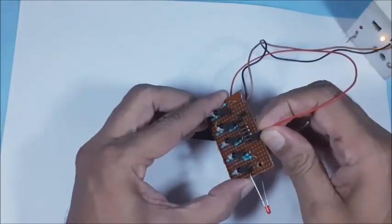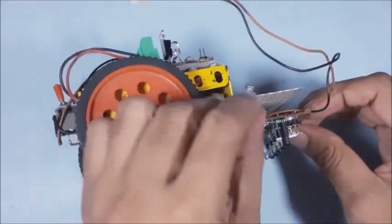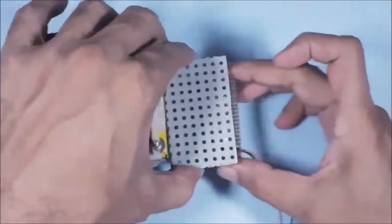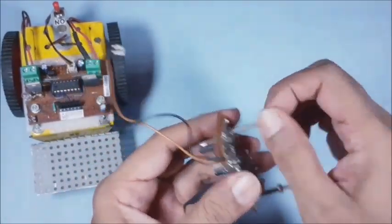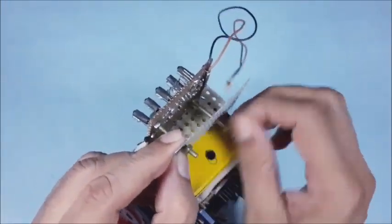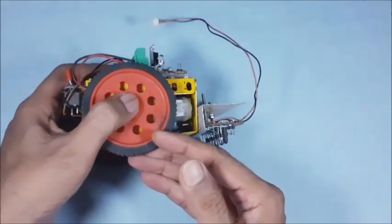Check all 5 sensors one by one. Now place the sensor board below the bracket and use suitable screws to hold it in the required position. Here, 2 holes of the sensor board are used. So use 2 long screws and nuts for holding the sensor board. Use 2 more nuts for adjusting the gap. Now position the sensor board below the bracket and lock it with 2 more nuts on top of the bracket. Then adjust the nuts to get about 5–10 mm clearance from the floor.